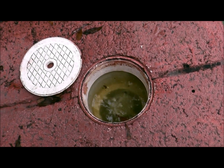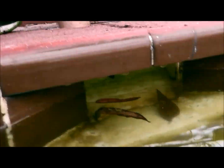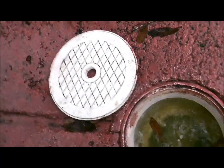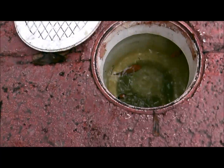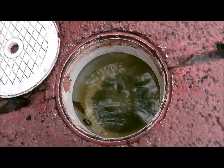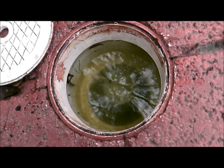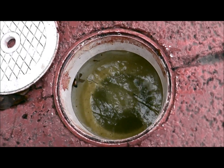Most pools have this little flap — it's called the skimmer weir. When the pump motor turns off, the skimmer weir pops up, and the tabs keep dissolving even when the system is off. So when the system comes back on again, this area right here is highly acidic.